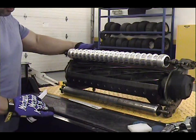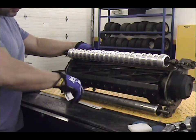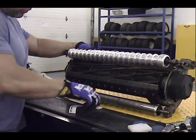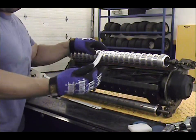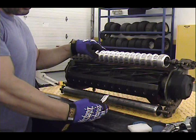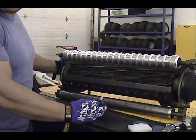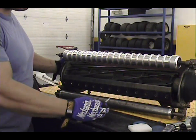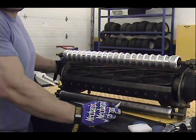All right. This is before we face the bed knife. Touch it. Obviously, there's no edge. Paper test. I just want to show you this ahead so you can see the results and the benefits of facing your bed knife can give you, alongside lapping or whatever your practice may be. I think facing your bed knife with a nice tool will improve your quality of cut.